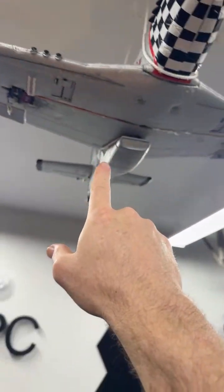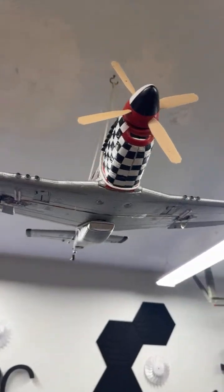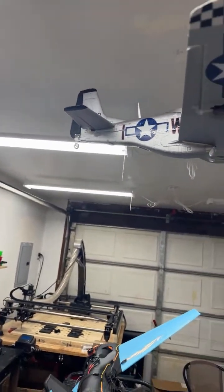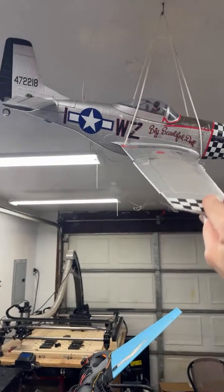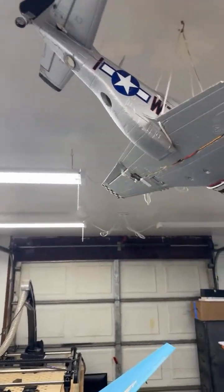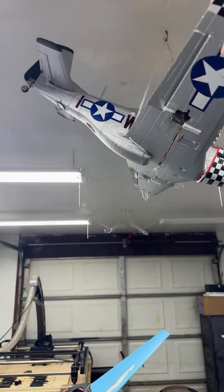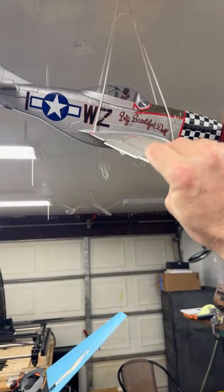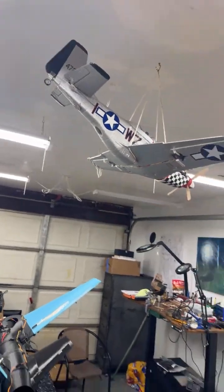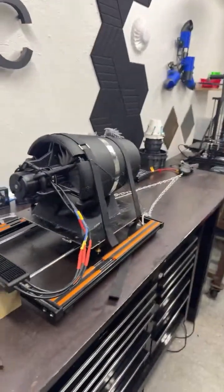I took the landing gear off because, let's face it, how often do I use it, right? You guys have seen me fly it in the past. And you notice I've got 3D printed props here. So, usually planes to this scale, I can't do the small ones. Give me a 2100 millimeter, I'm fine. You give me these little tiny ones, and they're real finicky in the air. But I also replaced the control unit in this. This is from FMS, but I also replaced the Reflex 2 that came in it with a Speedy Bee F405 wing, so I could do loiter mode and all that other stuff. But, yeah, that's where we're at.